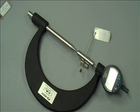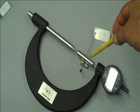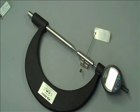What's being shown is the PD 8001 RSC with electronic indicator for measuring the pitch diameter of rotary tool joints from the NC10 all the way up through 6 5/8 regular. There are about 4 or 5 sizes that are larger than the 6-inch capacity of the frame itself. This is my NC23 rod standard, which I showed you previously on the mic track. We set the gauge to 0, press the center blue button when you get to your lowest reading, and you have just set the gauge to measure the pitch diameter of the connection that the standard was designed for.